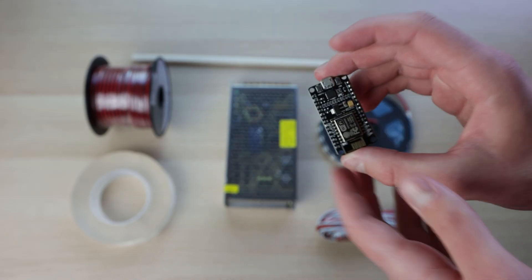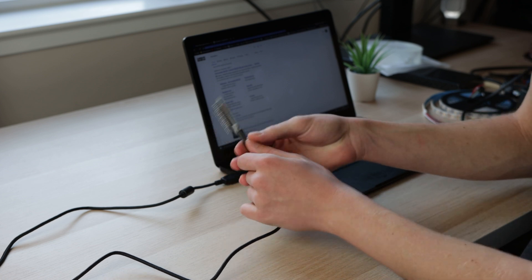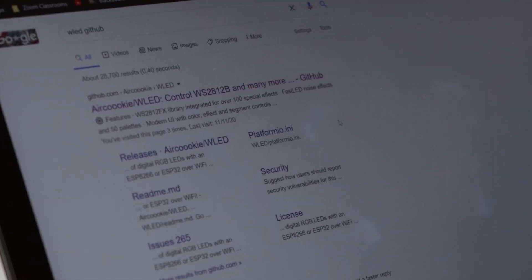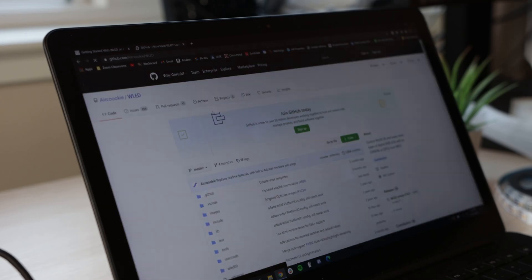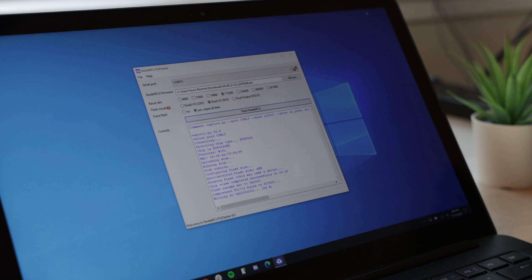The last thing you need to actually run the LEDs is this little ESP8266 — I don't remember the exact number, I'll put it on screen. You need one of these, and then you upload code to it that'll do everything for you, so you don't actually have to program anything yourself. The software I'm running is called WLED. It's Wi-Fi controlled, so I can control these from my phone and from my computer. You basically just download the file, download a flasher to flash it onto the board, and then you can start hooking things up.